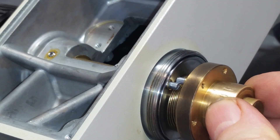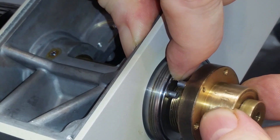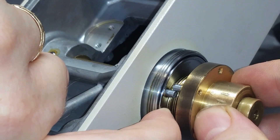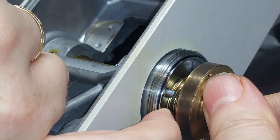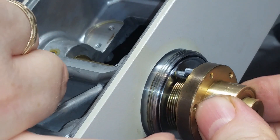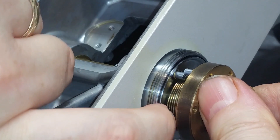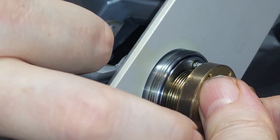So if I'm sitting here using this, wherever I go I would tighten down the collar and lock it. Now the stage can't go any higher. But if I turn it the other direction, the pins are free to move and separate, so the stage can be lowered but it can't raise any higher than that locked point. So if I turn this a quarter turn or so and then release the imaginary lock collar, you hear that slap. And as you can see, that's what's happening — the spring is bringing those two pins back into contact. That's the slap sound you hear when you release the lock while the stage is lowered. If you release the lock in the normal locked position, nothing happens. But if you lower the stage and then release it, you'll hear that slap.